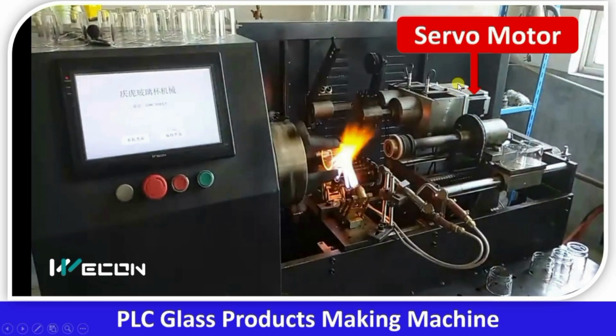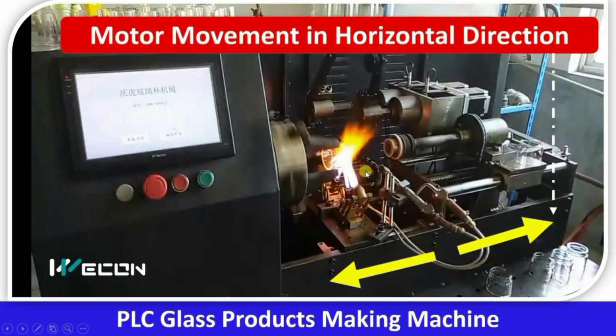After that, here you can see there are servo motors. This servo motor rotates this arm, and this arm is used over here for pressing or giving shape. After that, there is another servo motor below this assembly, which is used to move this assembly in this horizontal direction, as you can see from the arrow given over here.